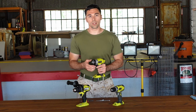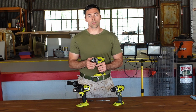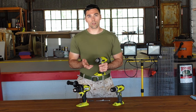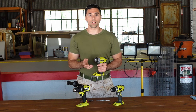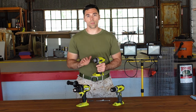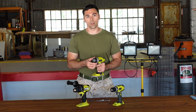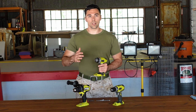Some people get confused about the difference between an impact driver and a hammer drill, because both seem to apply an impact force to the drill bit. But that's not the case with an impact driver — it produces its force in a rotational direction. While it still rotates the bit forward or backward, it also spins up essentially a spring on the inside. That spring compresses, and when it releases, it produces an extra jolt of energy to rotate the bit just a little more. Imagine going at a slow speed and then tapping on the gas to generate a large burst of power, then releasing back to your original speed. Another analogy is using a wrench and tapping it with a rubber mallet to produce additional rotational force. That's how an impact driver produces more rotational force than a standard drill driver.